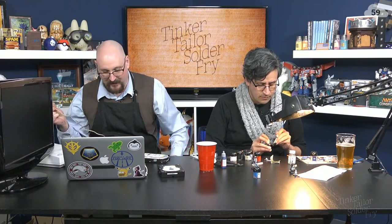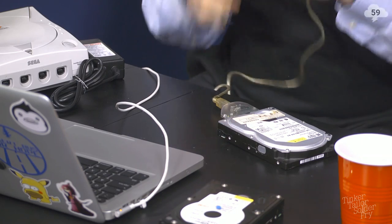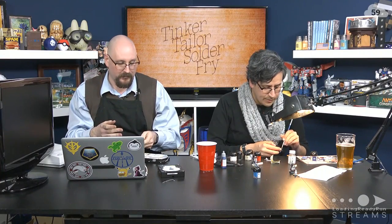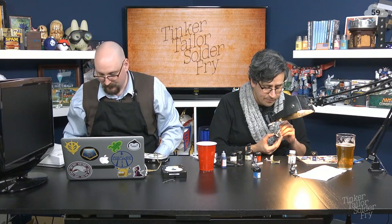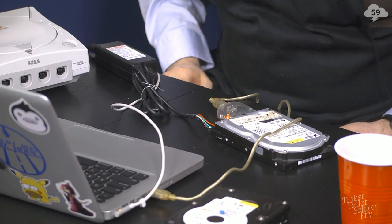Oh, yeah. Remember RAM disks? Anyone out there remember RAM disks? I don't. Could you explain to me what that is? A RAM disk was a great little feature that Mac OS Classic had, up to System 7, where you could say, I'm going to take this amount of my RAM and turn it into a disk that you could use between boots. And as long as you restarted your computer and didn't shut it off, the RAM stayed charged. Okay. So the real power users would take as much RAM as they could and put their system on it. So it was just super fast loading. Yeah, like the equivalent of a flash drive back in the 90s. Right. But you need to have enough room for stuff to live in RAM, and then to also be copied to RAM in order to run. Well, yeah. I mean, back then, 640K was an infinite expanse of RAM in which little COM and BAT files could run and frolic forever. Oh, and there would be a mouse driver, maybe, sitting off in the corner occupying some of it. That sounds a lot better.